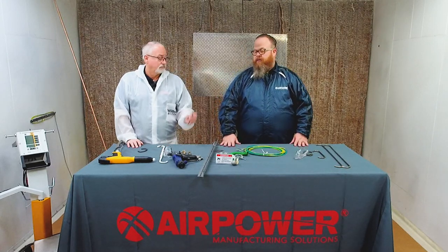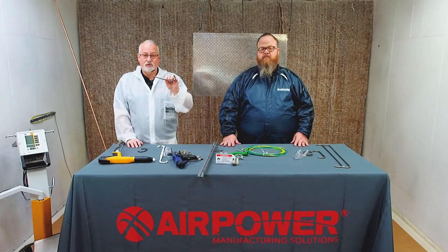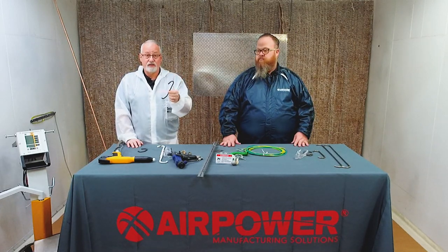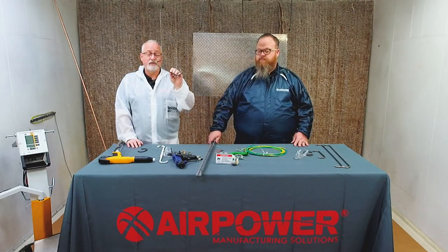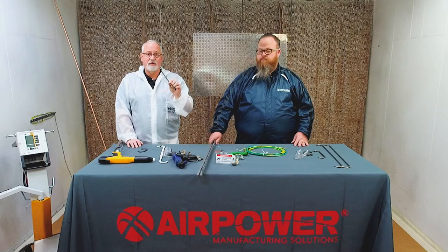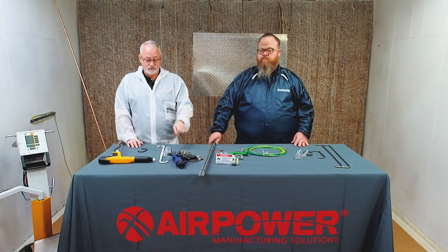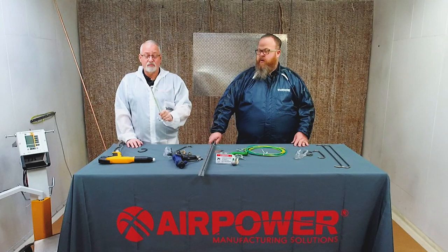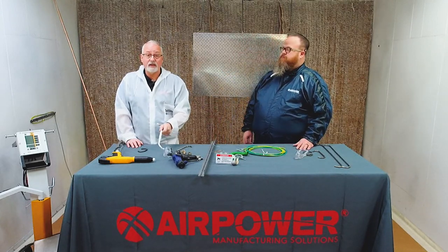So, hooks, we talked about hooks. Yes. It's critical to maintain ground. We did a video just a little bit ago. It's on everybody's mind in the shop. They just forget about it. You have to have good, clean hooks. You can't have hooks like this and expect a good ground. With proper ground, you get better transfer efficiency and it'll improve your electrostatic process. That's why you're buying an expensive tool.